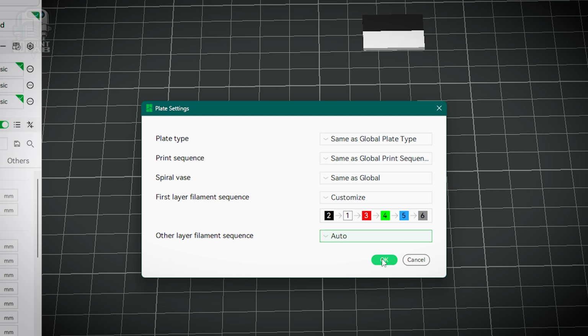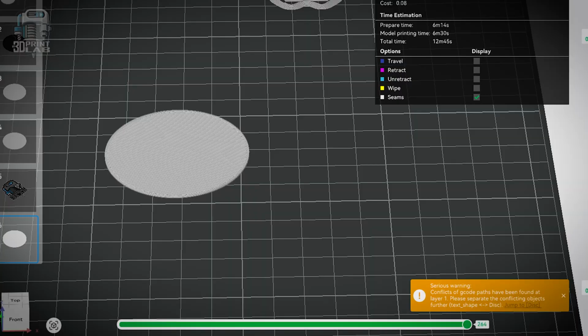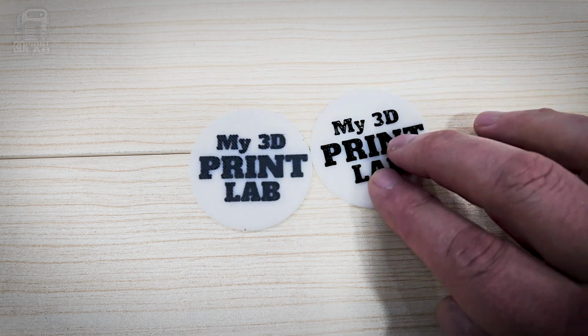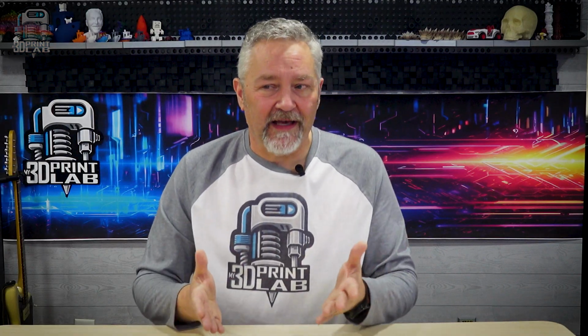Now this sounds great, except we still have that pesky issue with everything being on the same layer. Even with the build plate settings adjusted, after we slice we get the same error we got before. And though the print definitely looks better than the first attempt, the nozzle is still dragging through the previously laid filament. And again, that's not good.